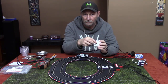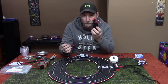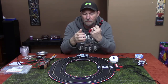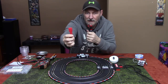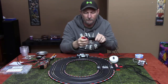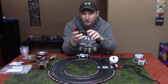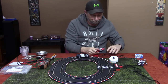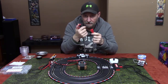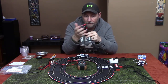The first thing I did was go to eBay and buy a couple of old controllers. They don't have to be newer controllers — they can even be broken controllers, as long as the connector end isn't broken, it's fair game to use. I opened up the screws from the controller, and all I did was take a soldering iron and unsolder the wires from the controller. The next thing I did was get my voltmeter to see how many ohms of resistance this controller had.